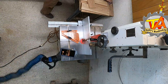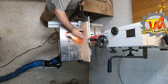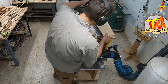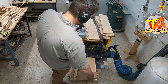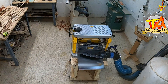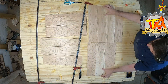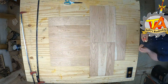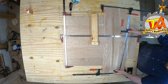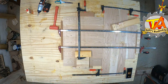I needed to resaw some material for the back of this project. After resawing, I took the material over to the planer to maintain the thickness of each board and to take off any rough surfaces. Tim laid the boards down that would make the back of the entire project. After using the template as a quick guide, I glued up this section, using plenty of jigs and weights to make sure everything turned out straight. Tim set the boards to dry overnight so the glue could set.